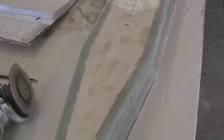Here I'm preparing the first spar for the external shearweb layers, and I've marked out where the spar is going to be trimmed off. There you can see 668mm from the pin. These dimensions you can get from page W16.2. The end of the external shear layers is a meter in from the center of the aircraft. So from that point there, measure a meter, which takes you to about there. That's where the shear layers are going to end.